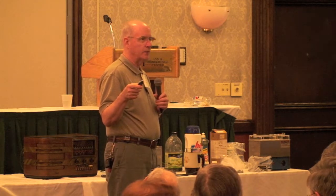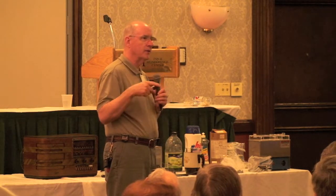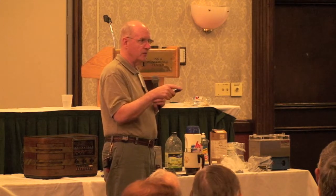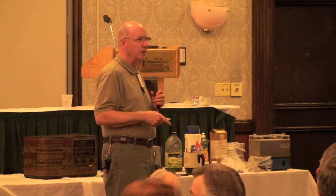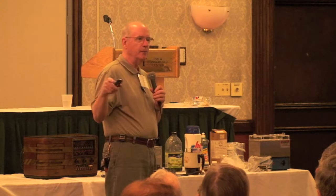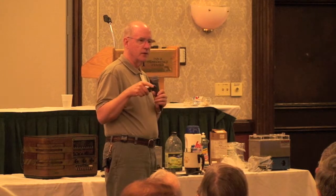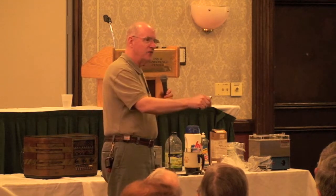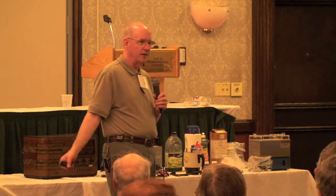I use that sometimes because it actually will renew. Sometimes I can use it in place of a volatile solvent. But if you ever have 409 or the Castrol Super Clean or Purple Power or any of those types of cleaners, keep them at least a light year away from any Bakelite surface, because they're caustic and they do dissolve phenolic resin. If you've ever seen that filthy old Bakelite case 30s radio, and you take the 409,